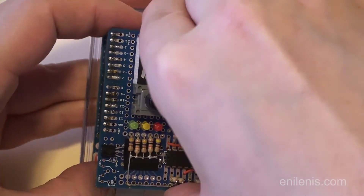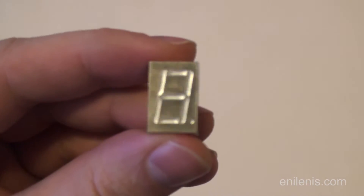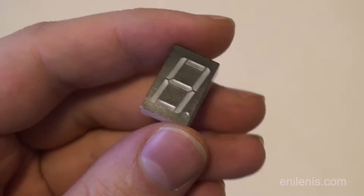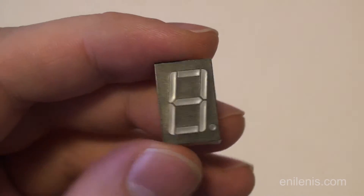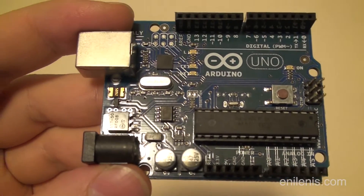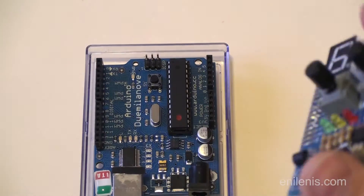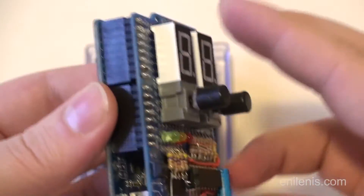The main reason for simplification is the limited number of I/O pins available in a standard Arduino. A 7-segment display, essential to this project, is an array of LED lights arranged in such a way that they resemble a digit. 7-segment is just what it sounds like — 7 lights — implying a minimum of 7 pins required to run them, or 8 if you count the decimal point. But we're not going to use it, since the temperature is going to be, for the most part, positive and in double digit values. With two displays, that's 14 pins already. Arduino has 6 analog and 12 digital I/O lines — a total of 18, not counting the serial communication pins reserved by the USB port. However, if we added three indicator lights, two buttons, and a temperature sensor, that would be 20 pins — pins that we do not have.